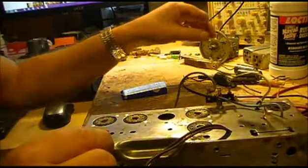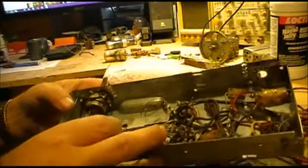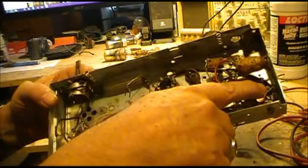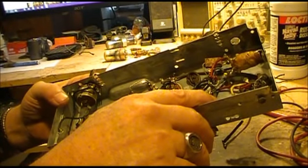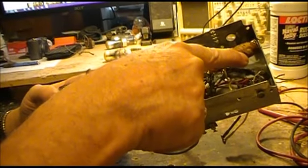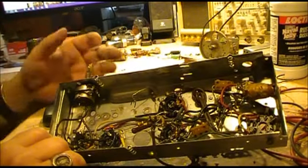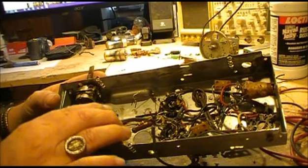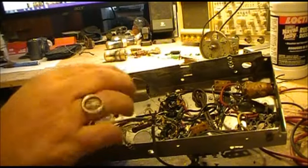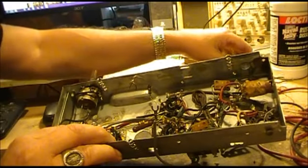One other thing about this, when I started taking out the electrolytics, if you remember, they were soldered down around this area here. Of course, the one was hooked wrong, but the other 2 were hooked up correct. One was hooked here on this coil, and then the other one was hooked over in here. The one was loose. I went ahead and just cut. That's where they were hooked, right here. I just cut this in because I wasn't going to mess with trying to get them off that resistor, since I was going to replace it anyway.